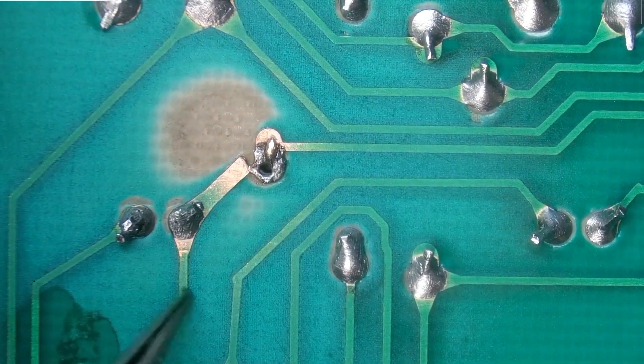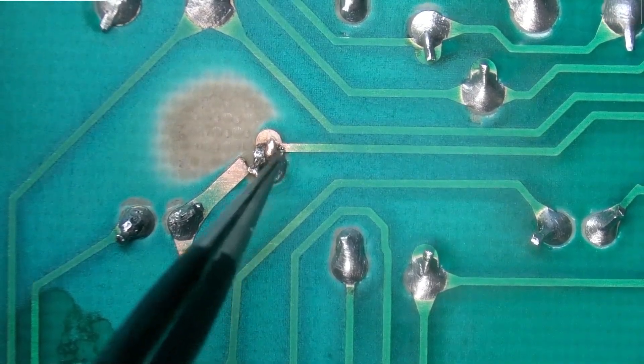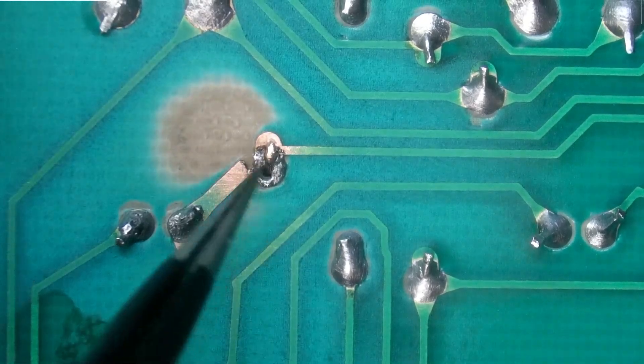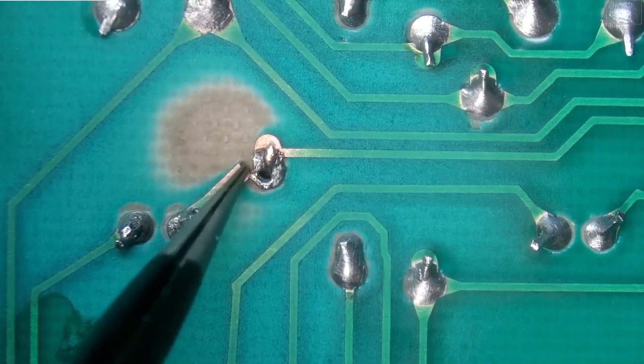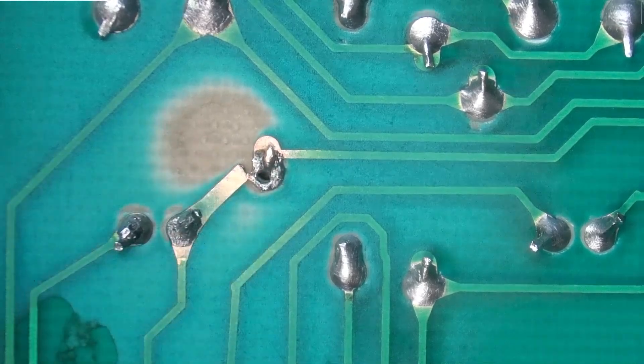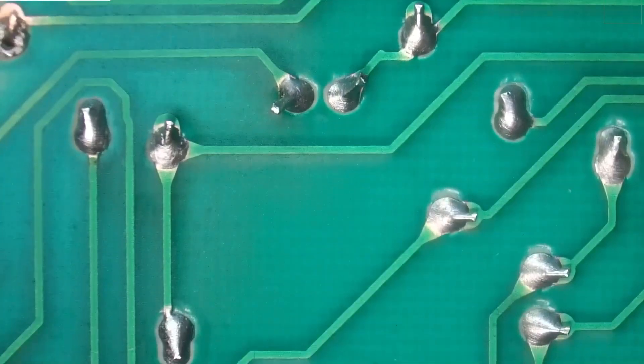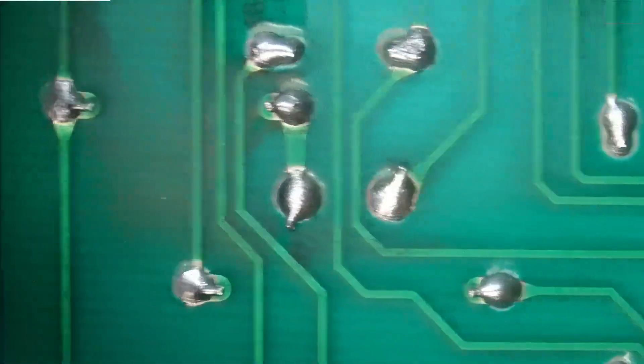What we're going to want to do is rebuild that. We're just going to put a wire — or a capacitor leg actually — to connect this joint over here to this one, that'll reform that bond right there and hopefully also strengthen the leg of the component here as well. Looking around, I don't see any other damage — it is just that immediate area.